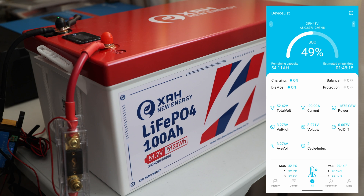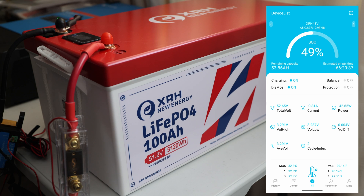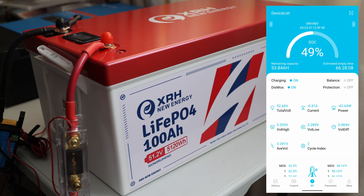Everything works, but my extension cord can't handle that much current. About 85 amps is the maximum I can pull — I'd need a thicker gauge cable connected to the Multiplus to draw more than 85 amps.